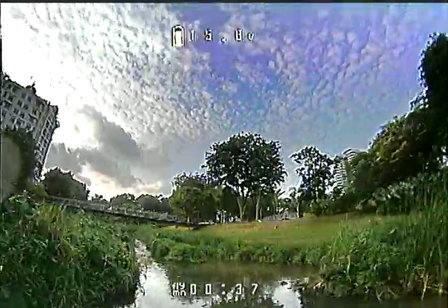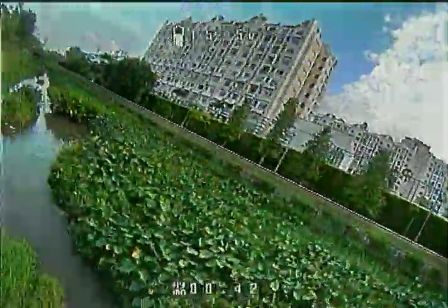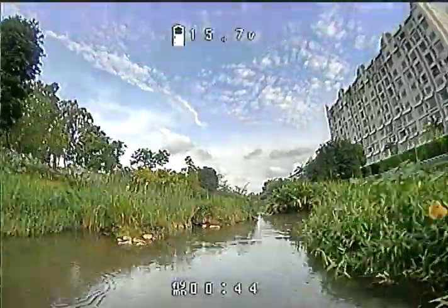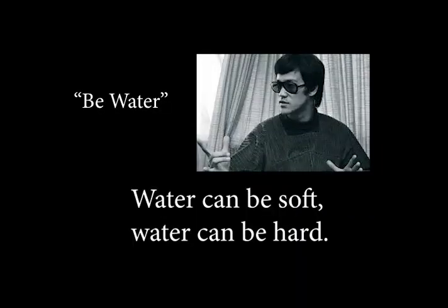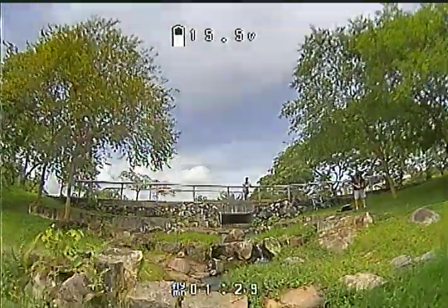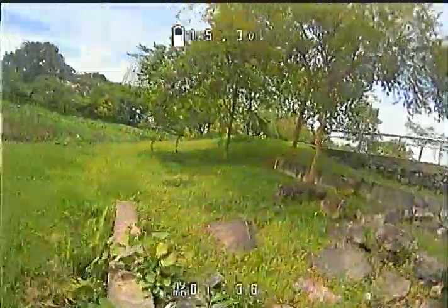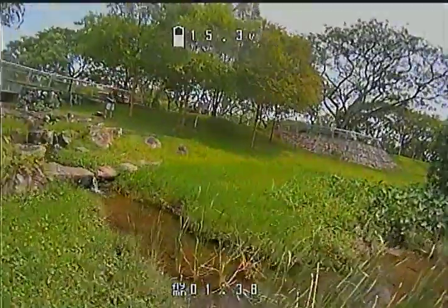Another reality is that while kissing the surface of water and pulling out is not an issue, dipping in water at a distance away from yourself, you lose both video transmission and radio connection. So please do not imagine that if your quad takes a dive in a lake, you can fly it back to you. It's so not gonna happen. But if you're close enough, well, you lose video transmission, but you still have radio connection to bring it back to you. Do note that crashing on water is just like crashing on any hard surface. The power surge might still kill your ESC.